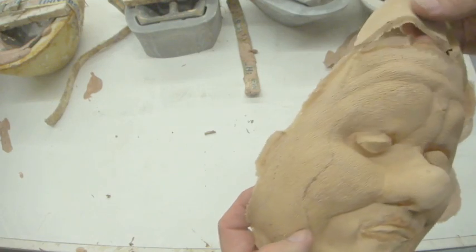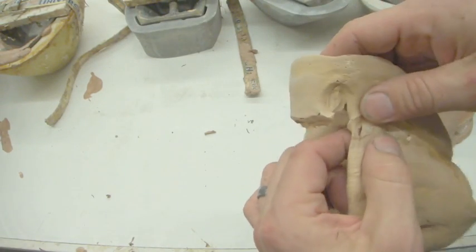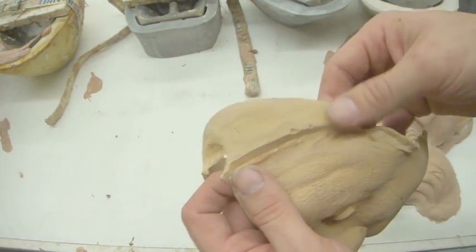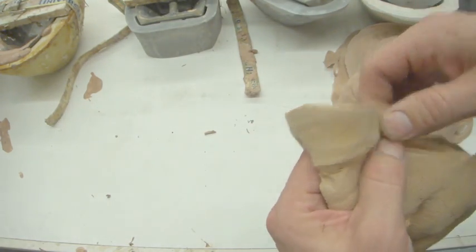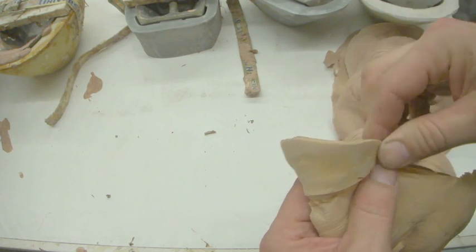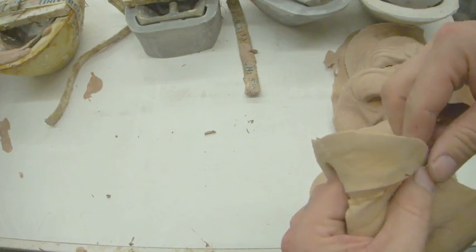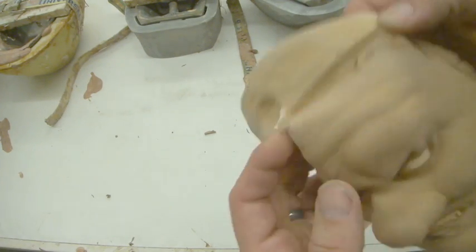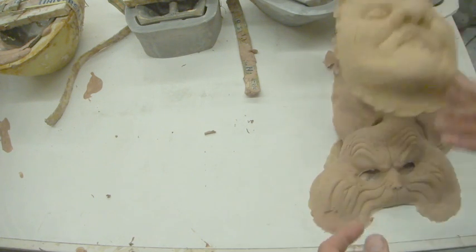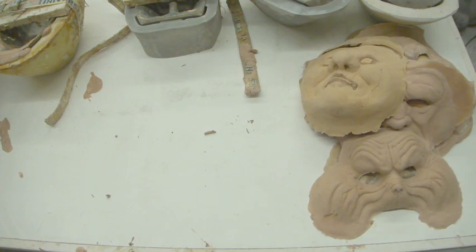But what causes the blending edge to do this is if your foam's gelling when you close the mold, and the cutting edge compresses slightly gelled foam, and it doesn't cut through it. It just smushes it into a hard rubber surface, and that's what causes that. So that's pretty much everything that can go wrong with your foam, and how to avoid it, what causes it. If you've got any questions about stuff, pop them in the comments below, and I'll answer them as soon as I can.